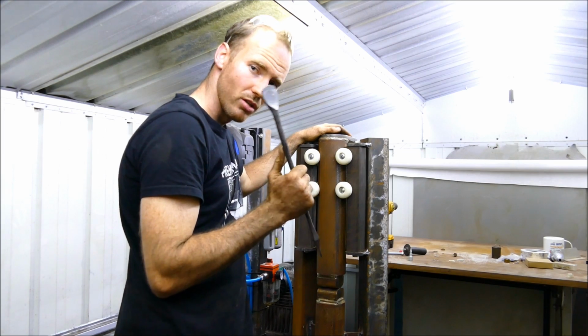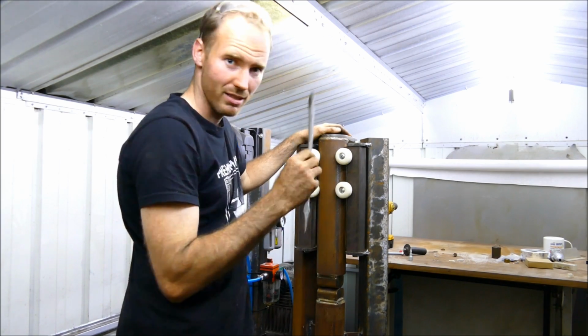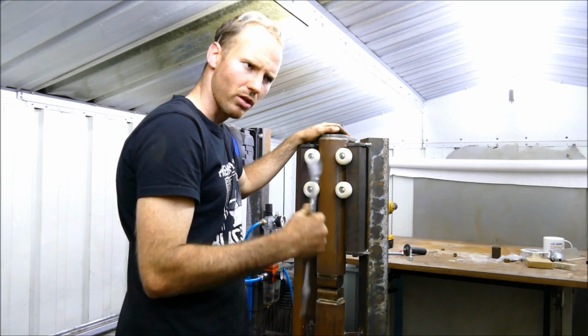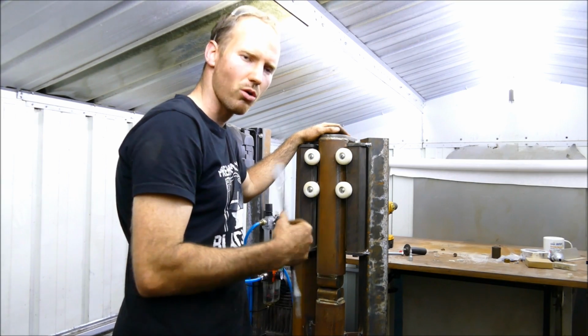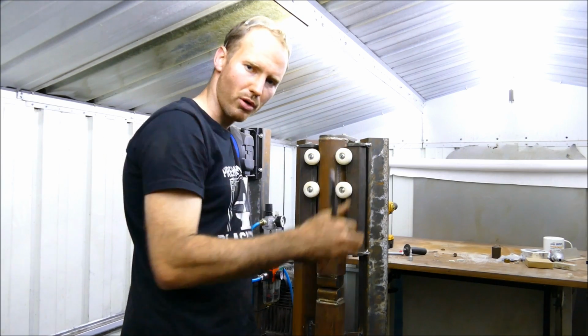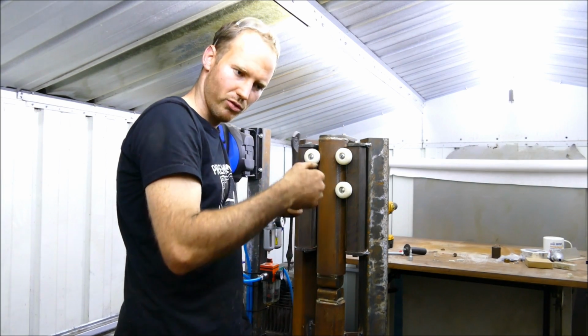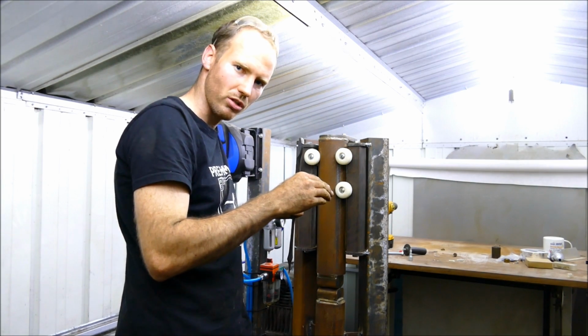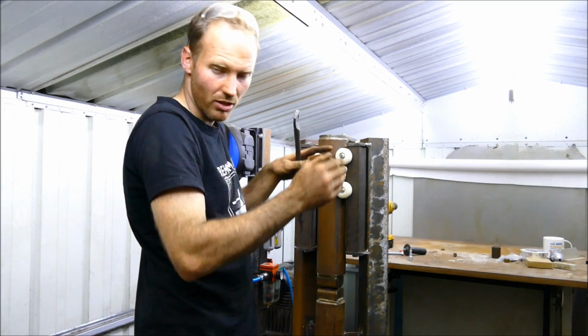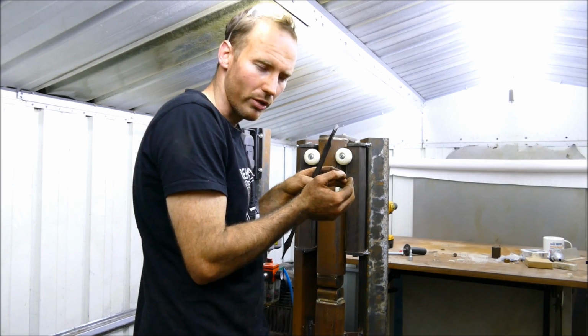Did I mention the horse sculptures that I want to build again, I also want to create patterns for you guys to build. So I'm going to reverse engineer the sculptures that I make so that you can follow the step-by-step process. Because to make some of the compound curves, you have to have already curved it in the flat position before you then curve it the other way in the compound way, which I will explain in future videos more in depth.